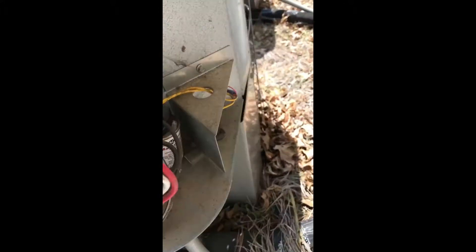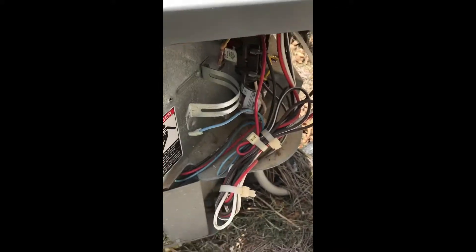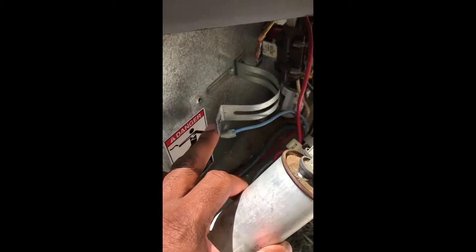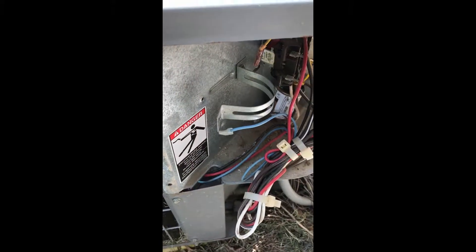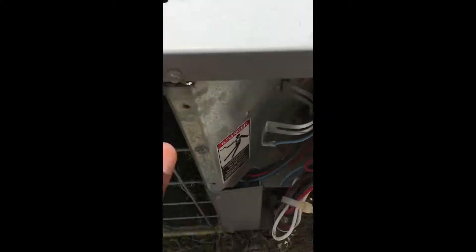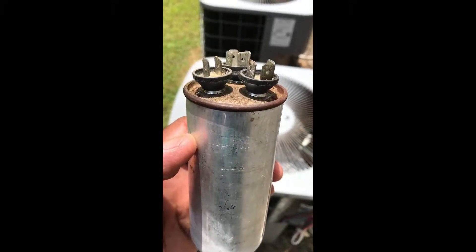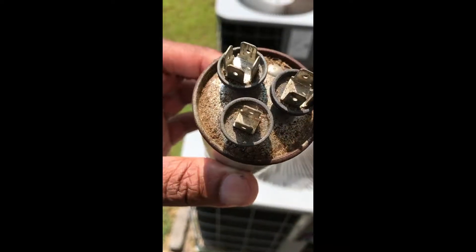So you just remove the bolt. Basically, we will just remove the bolt here. Once you discharge it first and take the terminal bolt, just pull it down, pull it out. And I'll show you all how to test to see whether your fan is not spinning or if your compressor on the inside is not turning on. Sometimes your fan is spinning but your compressor won't kick on. And if you look good, you can see the bulge in this capacitor — kind of see it in the bottom, see how it's pushed out from the bottom. It's not flat. So we're going to test the ohms and see what we get.